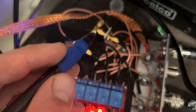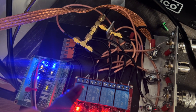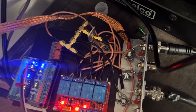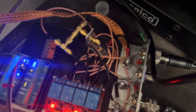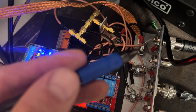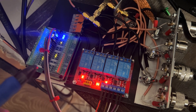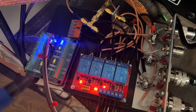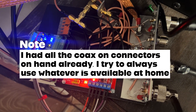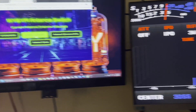Those comms come out through a normally open port on relays 1 through 3, and they meet up here in this junction I made from these SMA connectors. Then that all goes into the comm on relay 4, and relay 4 normally open goes to the shack SO239 right here. On all the normally closed, I've got a ground that grounds here, and then that goes out to the single point ground. This is a Raspberry Pi Zero with a Pi hat on top — just a breakout board to make wiring a little easier. Probably spent about 50 bucks on this project, maybe a little bit more for the Pi.